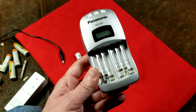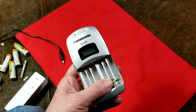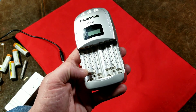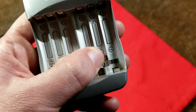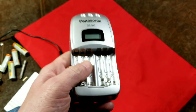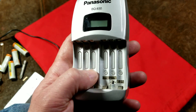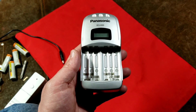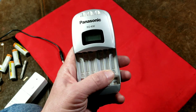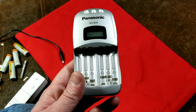Generally speaking, you want to put battery chargers in a pretty safe location — you don't want them sitting on carpet. Inevitably somebody is going to have a problem with any battery charger because the battery is in a certain condition or already hot. On this charger they have these little metal pads, which are actually heat sensors. They can detect if the battery isn't responding correctly and the charger didn't detect the cutoff point — if the battery really starts to overheat, it'll stop charging, trying to prevent a fire. But generally speaking, put them on a ceramic dish or some surface that's a little less flammable.